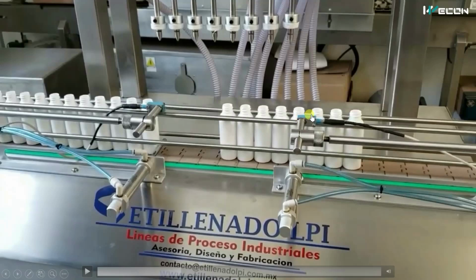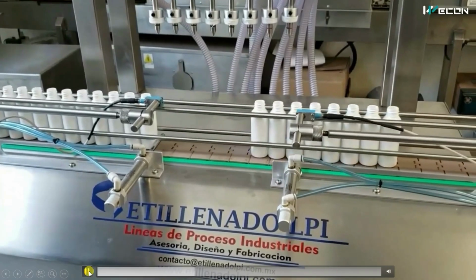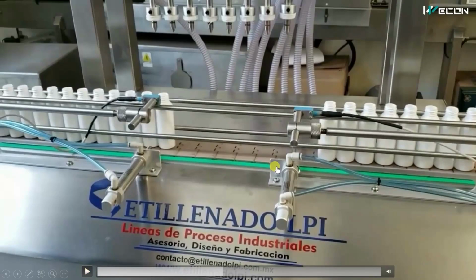Now the role of this photo sensor is to count these bottles. For example, here there are 8 bottles. So when the 8 bottles pass through this sensor, what will happen? Again, it will lock the production line through this cylinder. Observe that carefully. So it locked here and also unlocked this cylinder.